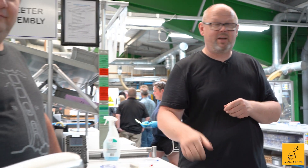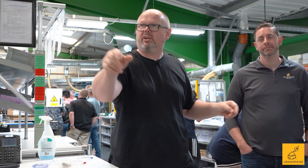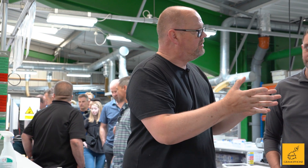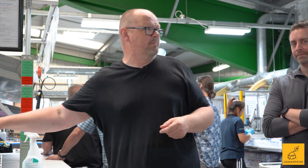I want you to imagine that what you have in your hand is a flashlight. The diameter across the front end of it is the lens of the flashlight. If you turn your flashlight on and point it at the wall over there, we're throwing a ton of light on the wall. Now take your hands and put them around the edges of your flashlight — point it at the wall. What happens to the light on the wall? Smaller circle — we reduce the amount of light output onto the wall. Translate that into audio: that's the exact same thing. The cabinet and everything around it has an effect on how much energy reaches the wall, whether it's light or audio. Putting this assembly this way means we are maximizing the audio from our domes and minimizing the amount of waste thrown into the cabinet — that shape is there for a very good reason.